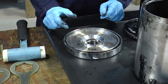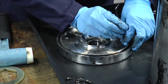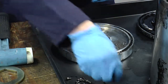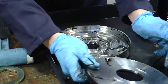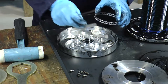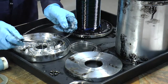To disassemble the top turbine, use a 3mm allen key to undo the eight screws. Once the eight bolts are removed, take off the plate where we have the top turbine. We then need to remove the mesh supports, take the mesh out of the unit — this can be disposed of — and remove the o-ring from the top turbine ready for cleaning.